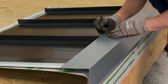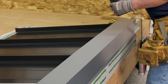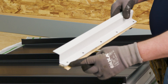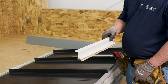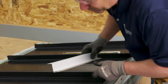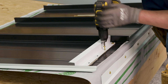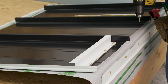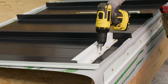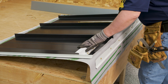Once the Z-closure is marked, we need to remove the peak again. We've marked our panel ribs and taken that back off. Our Z-closures have been pre-drilled — five holes per Z-closure, five fasteners per panel — with number 10 by 1 inch pancake head fasteners set in 3/16 by 7/8 inch butyl tape, attached to the panel per where you've marked your peak locations. We're attaching with number 10 by 1 inch pancake head fasteners. You want to get good compression on that butyl tape — that's why there's a 4-inch maximum fastener spacing for your butyl tape compression. Go through and install the remaining.